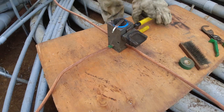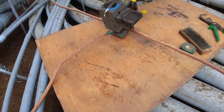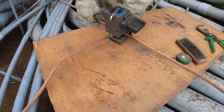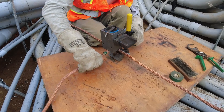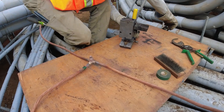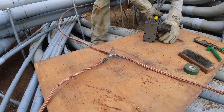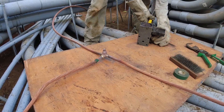How'd we do? Go ahead and open up the mold and take it all apart. The sooner you get in there while it's hot the easier it is to get it off the wire. Just give it a go — as long as it's not near any pipe and there are no other little scrap pieces. Just pay attention to all the little bread crumbs so they don't melt a hole through any of our four-inch conduit.